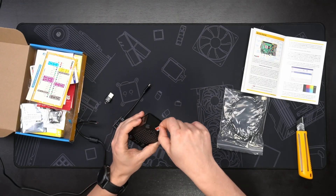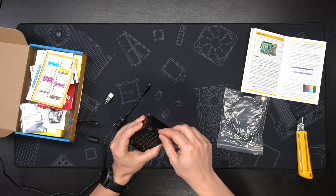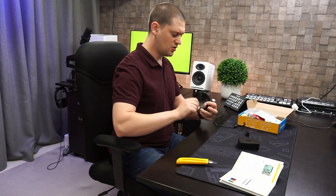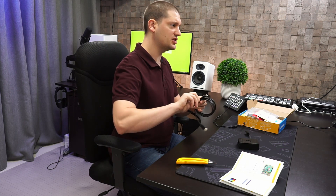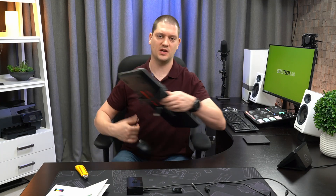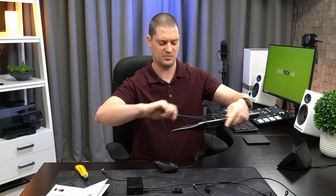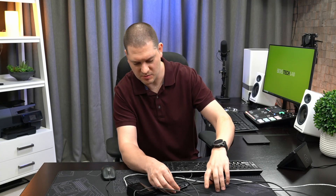Turn over the Raspberry Pi and just stick the SD card right in there. I won't normally have HDMI attached to this Raspberry Pi for Companion, but just for initial setup if we want to check what IP address we got and that sort of thing, I'll grab a keyboard and mouse — again, we won't be doing this normally. We'll give it some Ethernet and plug in the power last, just in case, and we'll boot it up.